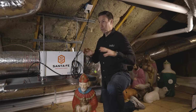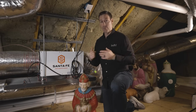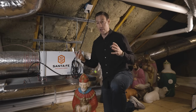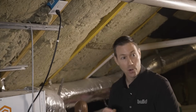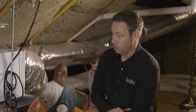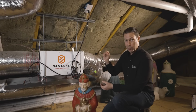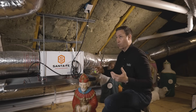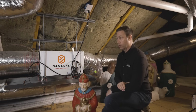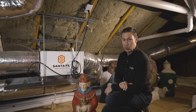So these dehums are not just handling the capacity of my house, the people breathing, my 7 total bodies in the house, including my black Labrador, but it's also handling the additional load of my fresh air system. So I like having a little bit more capacity. I think that's something that I've learned after being in here 2 years. We want a dehum up and a dehum down, but when they specify this unit works up to so many square feet on the website, I can't remember what the 70H says. It probably says it's good for a 2,500 square foot house.